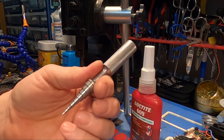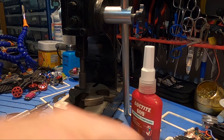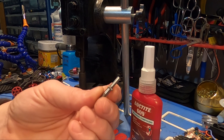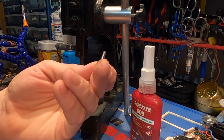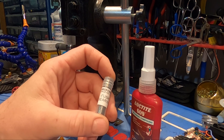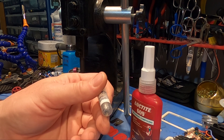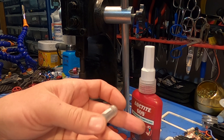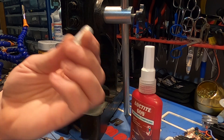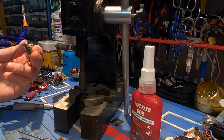You're going to need one of these bearing pushers. This comes in handy for removing and installing bearings. You can also do it with the arbor press, but with how tight these bearings are, I prefer using this tool. You're also going to need a motor shaft — we'll get one out of a motor to show you. And you're going to need bearings. These are ABEC 7 bearings, which is fairly high quality. To be honest, none of these bearings in these motors are really ideal for the application, but it's all we can get in that small size. Bearings go bad and you have to replace them if you want decent footage.